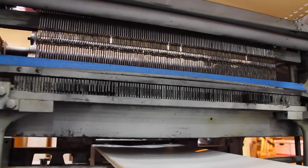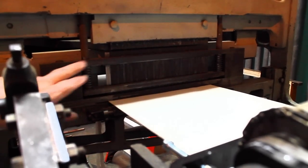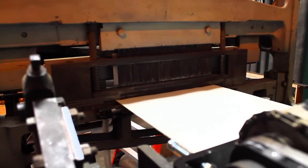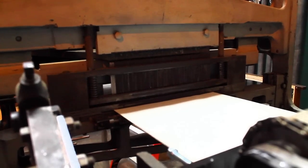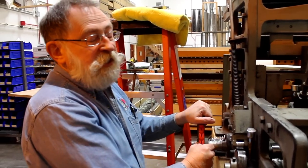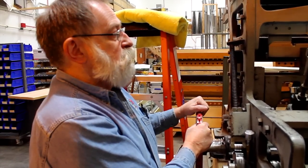It comes down, the interposers are withdrawn. The paper is drawn forward 1 notch, the master roll forward 1 notch, and we have 1 interposer out here to stop that punch, which then allows that 1 single hole to be punched. And this goes forward with each revolution of the machine. We run approximately 4 punches per second maximum speed. Originally, it punched 8 punches per second, but we don't want to run the machine that quickly. It's very old and has some rather fragile parts in it.